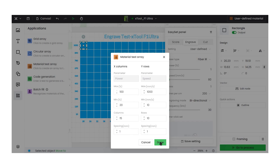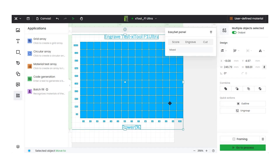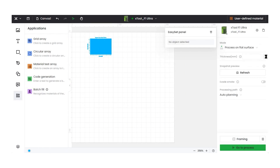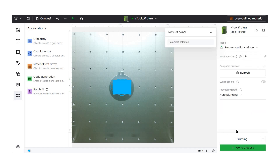With all of that set, I hit 'Done' and this is my test array. I don't want to change anything from here, but I'm going to make it quite a bit smaller because my piece of stainless steel is quite small. Over on the right, if I click off the test array, I can now measure the thickness — this lets the F1 Ultra auto-measure and determine how thick the material on the base plate is. Then I refresh the camera to get a view of the tag sitting in there, and I take my test array and size it to fit on the circle. Let's process this and see how it comes out.